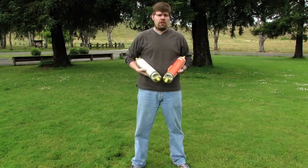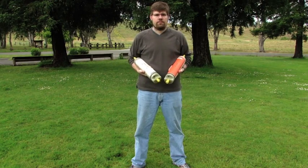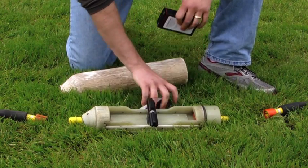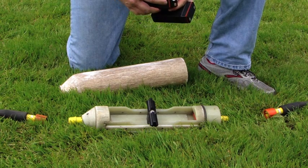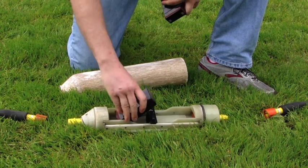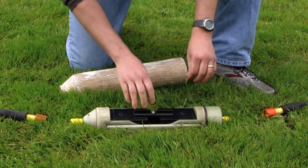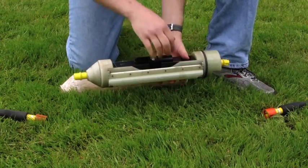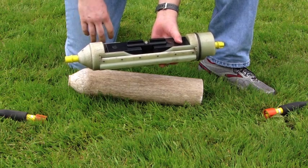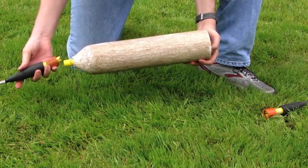The O-Mapper consists of two primary modules: a transmitter, which is white, and a receiver, which is orange. First we take the white transmitter module and we install the batteries. Remember this little tab faces up and the battery contacts face out, whether towards the back or towards the front of the module. Just insert them in and then snap this knob into place. Now I have to install this protective shield — note that this little nose points front, towards the receivers and the console. So we just slide the cover over, and now we install the cables.